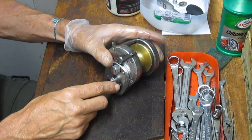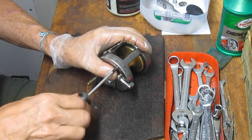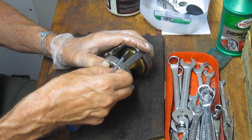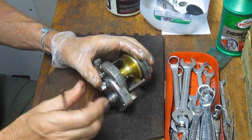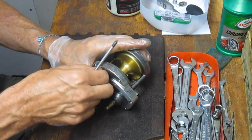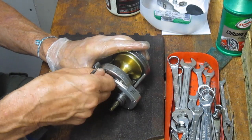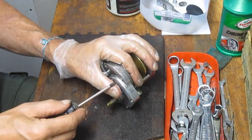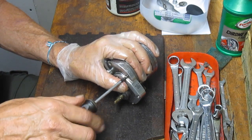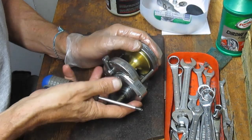Now let's get over to the side plate where all the business is. I did take the opportunity to loosen the side screws earlier, and I'm going to pull them now. A lot of folks ask me about the mechanical screwdriver for things like side plate screws. I don't recommend that at all — if they're stuck like that handle screw was, you have a high risk of ripping the screw out, ruining the slot, or breaking a head off. I like to work with my hands and damage as few pieces and parts as possible.